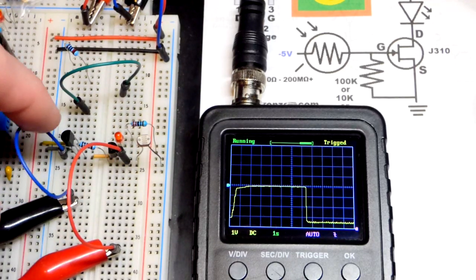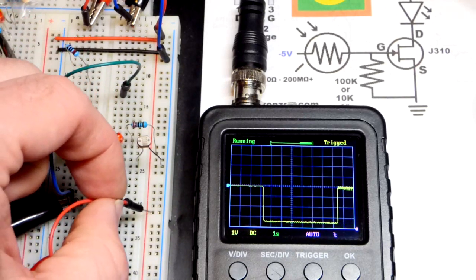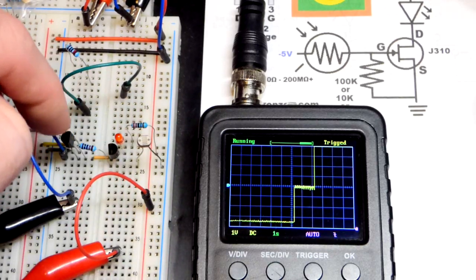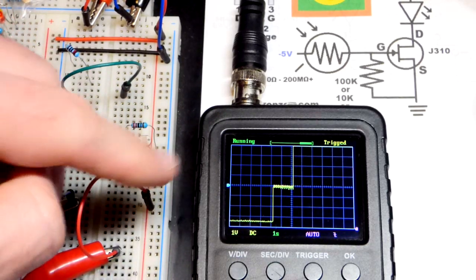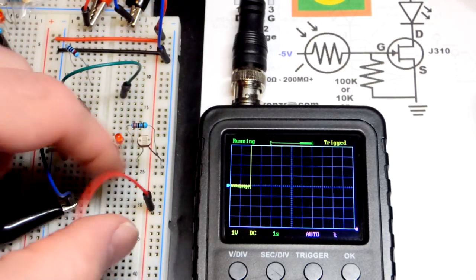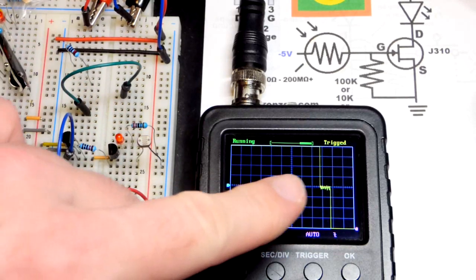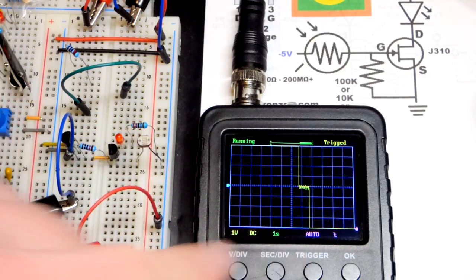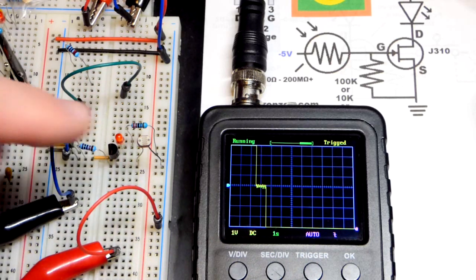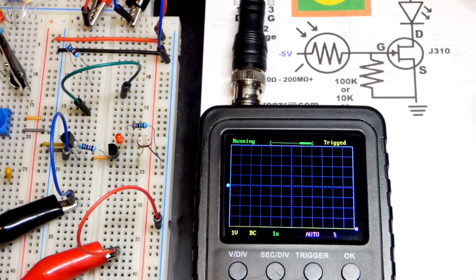And so, as I said before, I used a rail splitter integrated circuit. In relationship to ground, where we designate ground using the rail splitter, the positive rail is 5 volts above there. There's only 4 squares there though, so it's off the chart. But in any case, we also have 5 volts negative, and that goes to 4. But as we could see, all we had to really see to know what was going on was between about negative 2 and about negative 3.